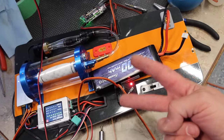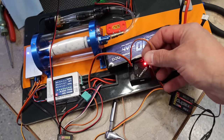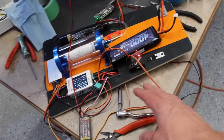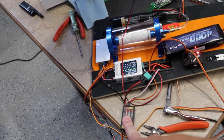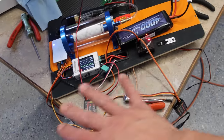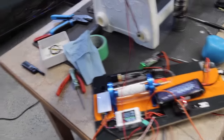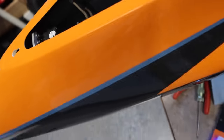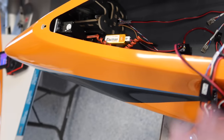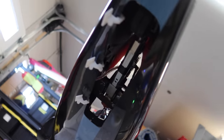Change the Cortex to be a two receiver system, so now it's getting a signal from the primary receiver and the secondary receiver, and we also verified that if we take the primary receiver offline, the secondary receiver still runs everything and vice versa. So that is all good. We've got our plan laid out there for the tray. We got the front landing gear all reinstalled with blind nuts. Now that'll have to come back out, so it's not permanent now, but that is awesome.